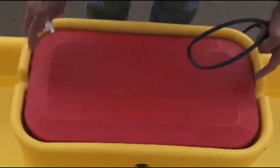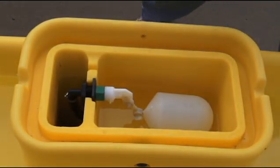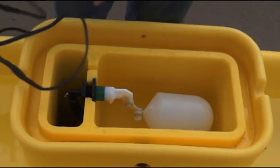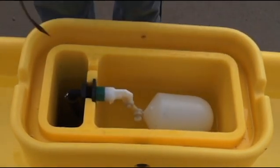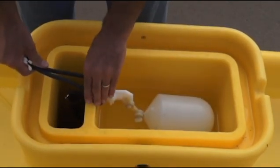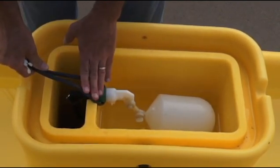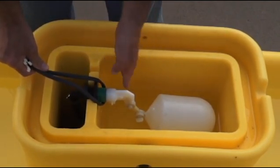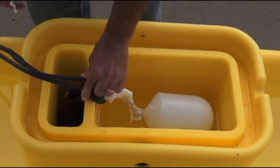I'm going to go ahead and remove the valve cover. Set that aside. You can see our three-quarter inch valve. So I have my self-regulating heat cable, and I'm just going to wrap this around this valve quick. All of our units that don't have the heat installed, whether it's got the three-quarter inch valve or the half-inch valve, are all going to use the same self-regulating heat cable. They're also going to use the same optional immersion heater that would go underneath the float here in the valve chamber. So I've got my heat cable wrapped around my valve.